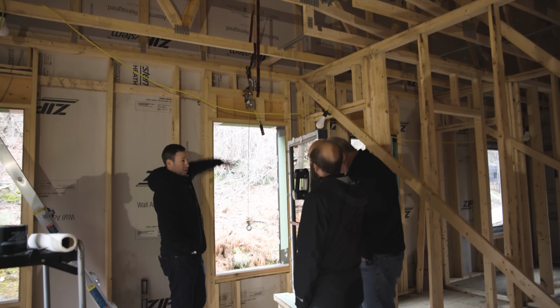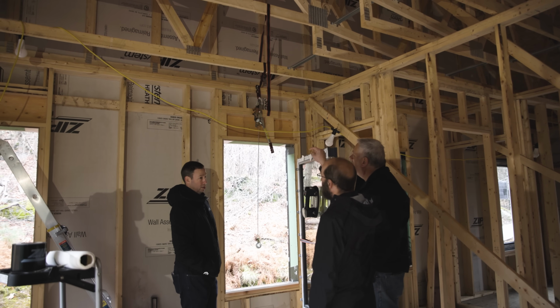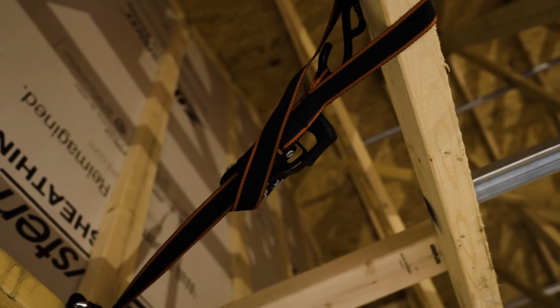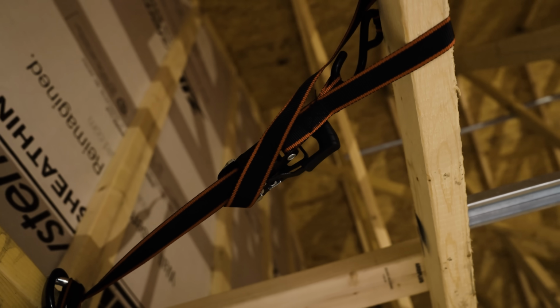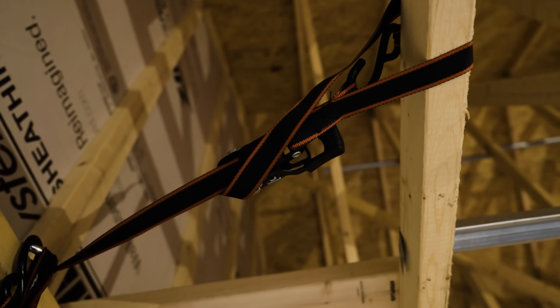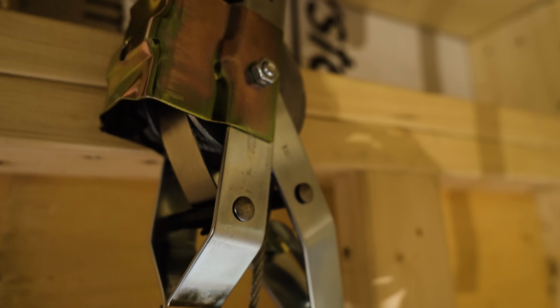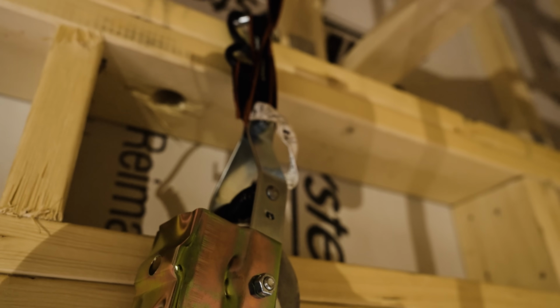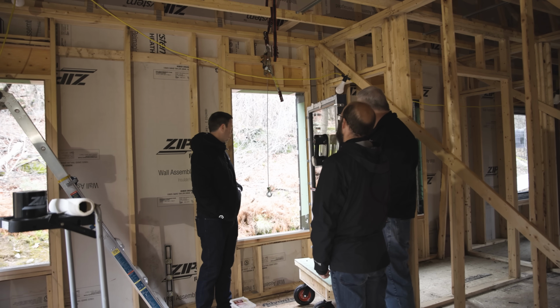That's about a 2,500 pound capacity D-ring that you'd put like in the back of your truck or on a flatbed. They swivel, they have 2 bolts. There's 2 3/8-inch bolts that go through that top plate, just down vertically into the double top plate. And that holds that D-ring right at the edge of that top plate to give you massive leverage to keep that thing from spinning. So there's no way that thing's gonna come loose.